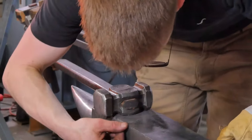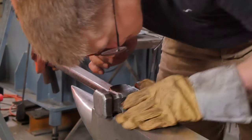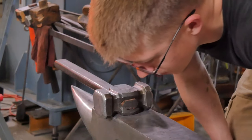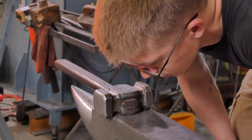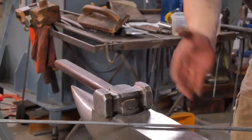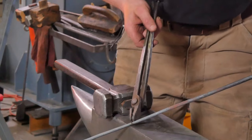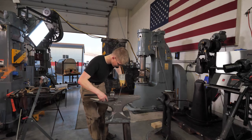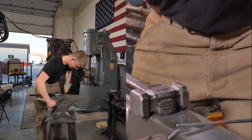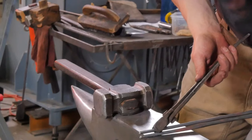Okay, so I'm having a look at it, and I'm seeing what effect that had on the edge. You know, I'm cutting a piece of work-hardened cold metal using this sharp edge, and frankly, it looks okay. It looks really good. It's not rolling, I'm not seeing any chipping. It looks just as sharp as anywhere else. So that's good. So this achieves a cold cut. By nicking the metal like this, which I hope you can see, it means that as we bend it, we can concentrate the stress, ding, and exert so much force over such a small amount of material that it breaks right in half.